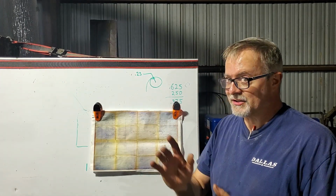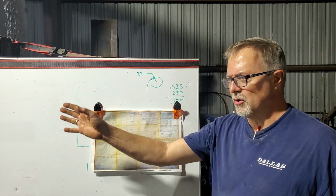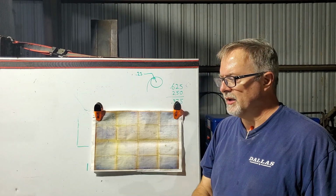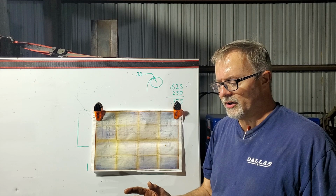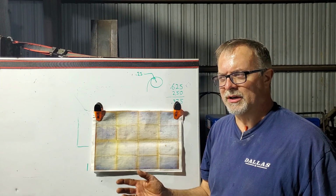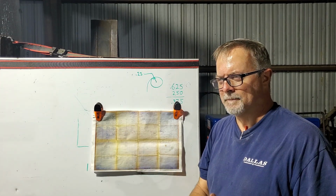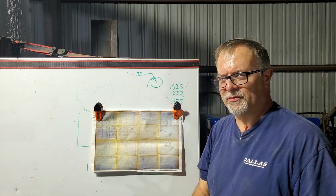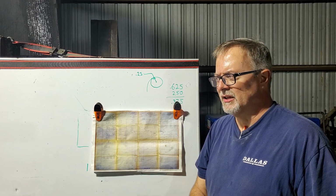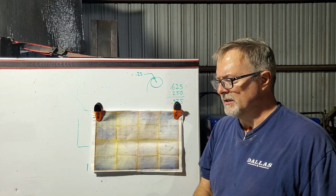Internet coming Sunday. That's tomorrow if you're watching this on Saturday, and we'll see. I've got power ready for it. Got an uninterruptible power supply, 500 volt amp. Everything that I'm going to be plugging into it only draws, I think, 24 watts total. It's a modem, a router, and a little AC adapter for the fiber converter. So, 24 watts, and that'll last a couple hours, maybe 3 hours on that power supply. So, looking forward to that.